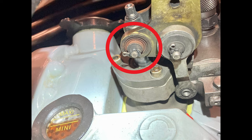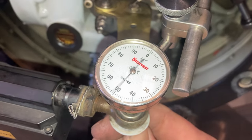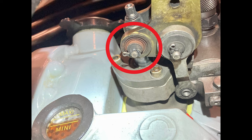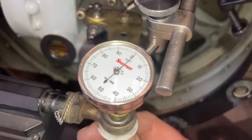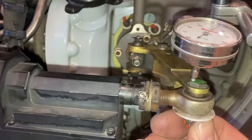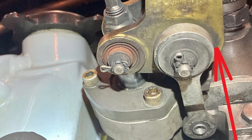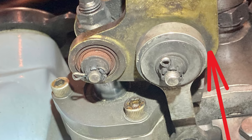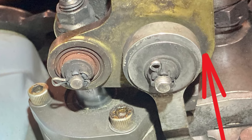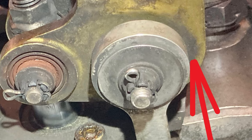If this helicopter comes to you for this inspection, this is probably one of the first things to look at, because it might take time to get the yaw servo actuator. If you see leaking or corrosion on that lower bearing, and it's your aircraft, go ahead and order it ahead of time so that when it goes to a maintenance shop you don't have to order it AOG and lose your discount — probably thousands of dollars. Also, look at the input link attached to the input lever: if you see gray dust-like material there, that means the input lever is wearing on the flange of the yaw servo.